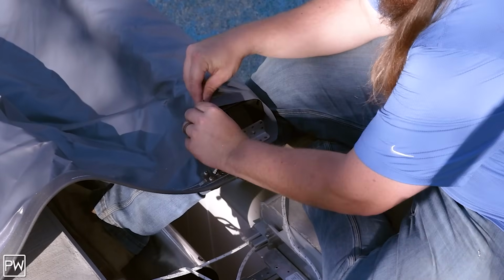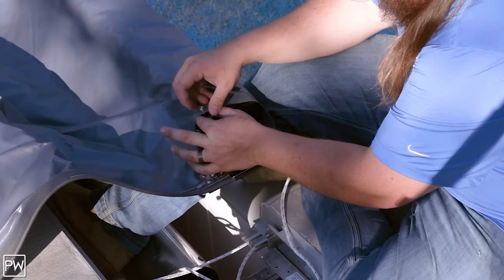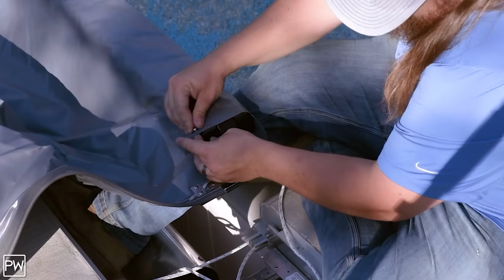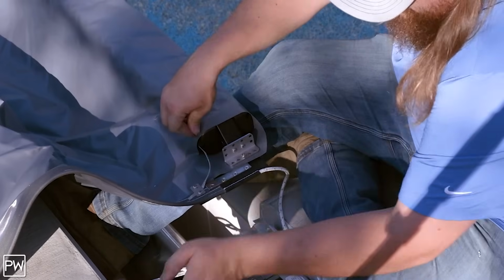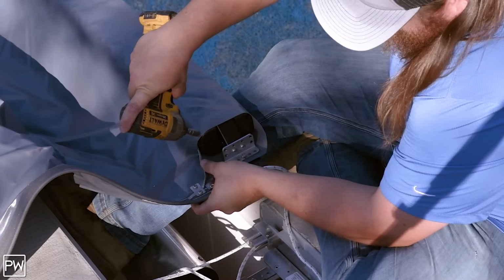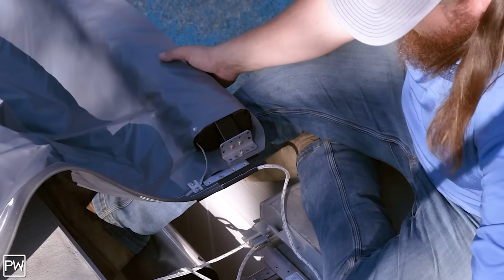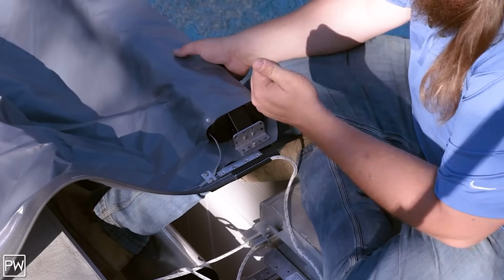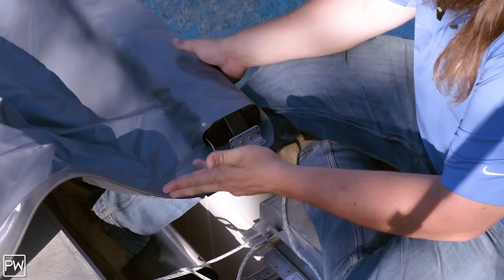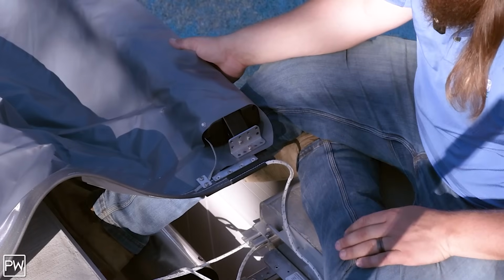Start our screw back in by hand. Again, it's right here on the edge of the aluminum. Gonna go through the eyelet, the bond wire, line it up with the same hole that we already just drilled, and just gently put that in. So just so we remember, review here, that screw is going down through the fabric, through the eyelet, through the aluminum, and into the black plastic cap. It is serving 4 jobs at once, so we just want to make sure we get that right.